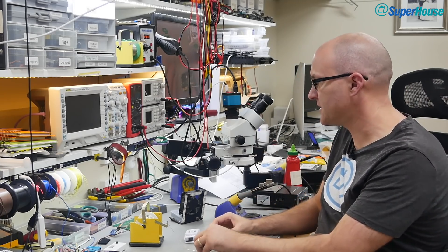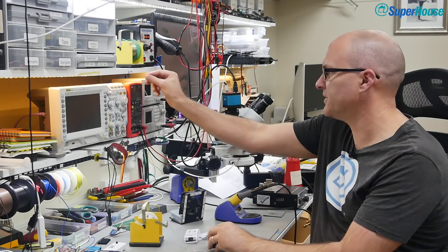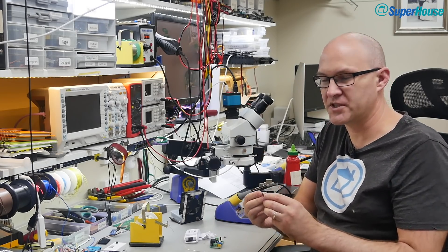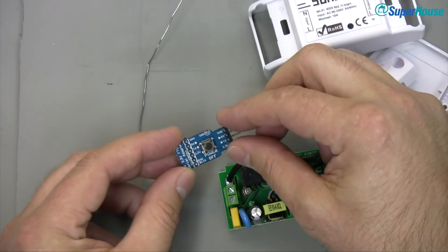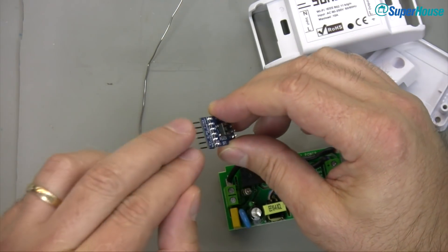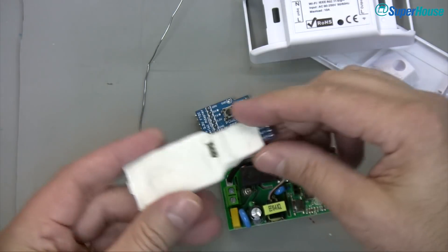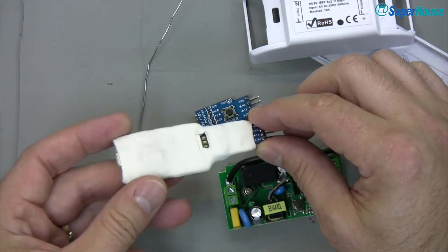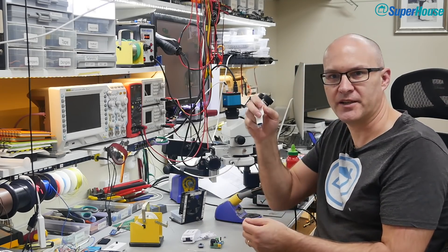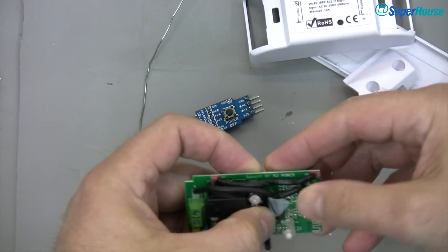What I'm going to do with this little Sonoff Basic, which I'm just going to use for demonstration purposes, is get this four-way header and solder it in on the little programming header. And then what we can do is either use jumper cables or, because I'm lazy, I designed this little device — it's a Sonoff programming adapter. It provides a four-pin header on one side that goes into the Sonoff, and a six-pin header on the other side that goes into a USB to serial converter, like a 3.3 volt FTDI cable. I just have one of these sitting here on my bench ready to go. So now I'm going to solder that little header in place so that this Sonoff is ready to be flashed.